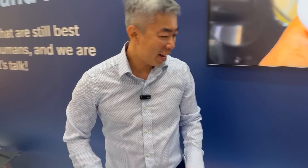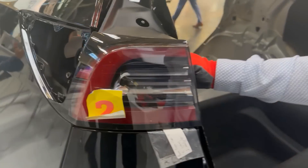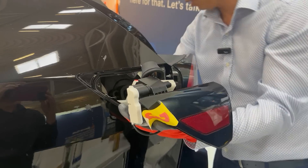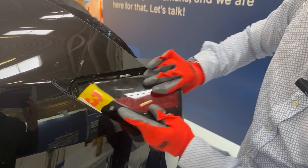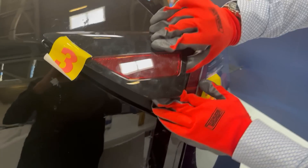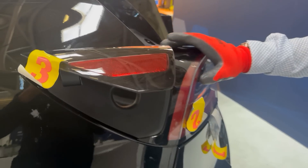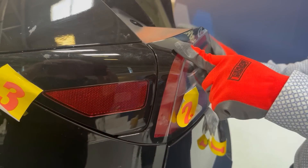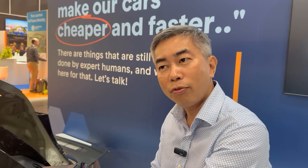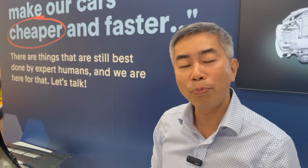The tail lights just fit in — you have two fasteners in the back to keep the tail lights. Most importantly, the tail lights are coupled with the charging port door. The charging port door is black because it blends right in with the tail light, so it does not have to be body color — everyone can use the same black. They positioned the charging port here specifically to couple the opening with the tail lights — so only one part, complexity reduction again.